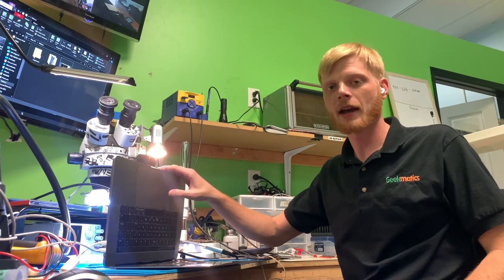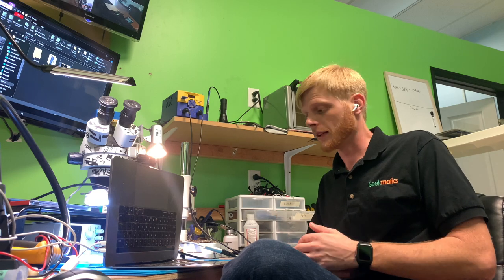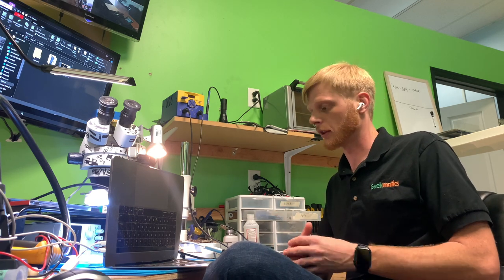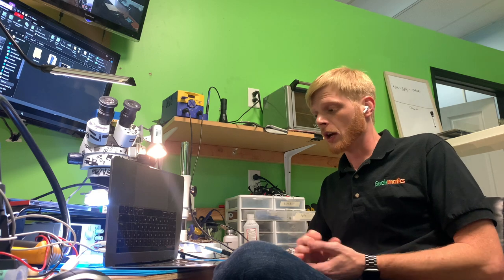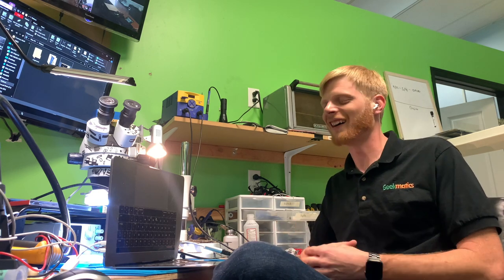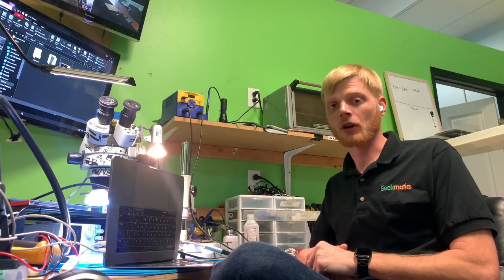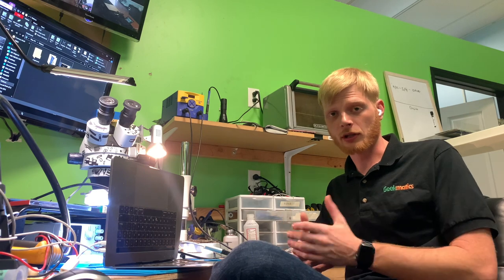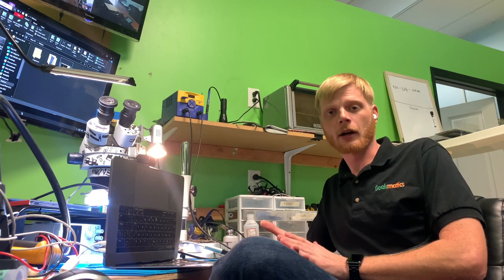Just a quick review of what we did today: a client got mad at his MacBook, threw it on the ground, then realized he needed his data and opened up the MacBook — kind of all the bad ideas you can have in one. Then he sent it in. Because the damage was so extensive on the housing, we took it out of the housing, made sure nothing was shorting, and did a visual inspection on the board, which found some corroded resistors that turned out to have nothing to do with our issue — but we replaced them anyway, so now the camera works. We put the board back in the housing, connected the battery, and started pulling data. We're getting his data now. Also, I've already purchased new cameras and lighting — Amazon says it should be in by end of the week, so expect higher quality videos. Until next time, I hope you enjoyed and learned something.